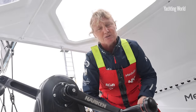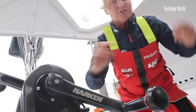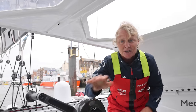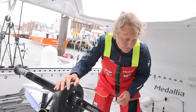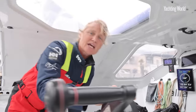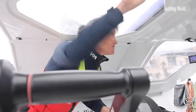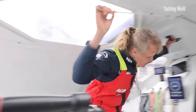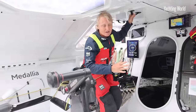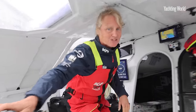The only other thing I need to do is when I reef, I need to go forwards and change the Cunningham up the reefing positions, so just leave the cockpit for that. But everything else — all the trimming, all the foil adjustment — I can do from these winches in here. Most of the time when I'm kind of scudding along, there's a lot of water comes over the deck and the boat's bouncing around a lot, so it's quite important that I've got handholds everywhere. You see up here, loads of lines to hang on to, and these grab handles here. When I'm moving around the cockpit, I'm really thinking hard about where I'm going to go, where I'm going to put my feet, and just never let go because it's so easy to fall.